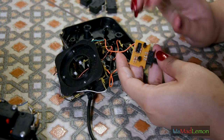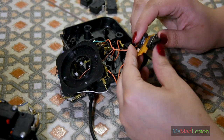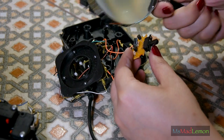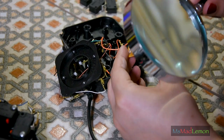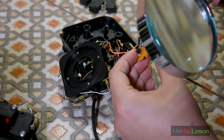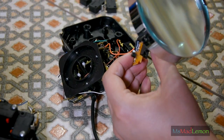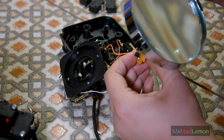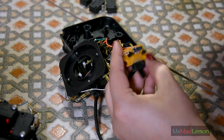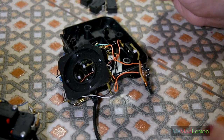First things first, let's check out this autofire circuit which doesn't work. Let's check out which transistors these are. I can't believe I still have this component tester — I remember seeing it around when I was five. So this is a BC547, which is an NPN, and a BC327 which would be a PNP. These two are just general purpose transistors — you can just replace them. Let's see what I have.